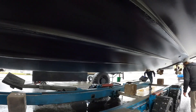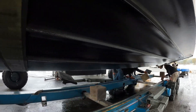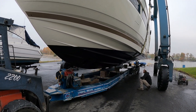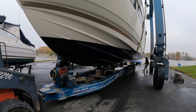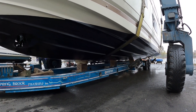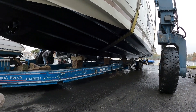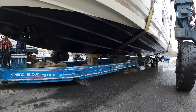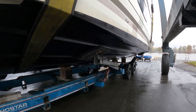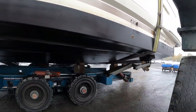At this point they're doing a lot of little minute movements, forward and aft. They're going to reposition the boat using the straps to lift it to starboard or port as needed, making sure the boat is level and properly balanced, and that the blocks are properly placed right where the stringers are underneath so that you're not sitting in any soft spots and the vessel is properly weighted and positioned to be moved. The hydraulic arms are being raised into position to cradle the boat, then the straps will be taken off so the boat is cradled and held properly for transport.